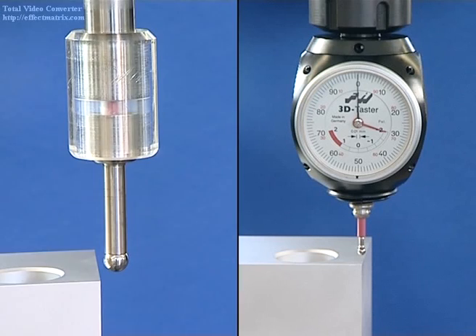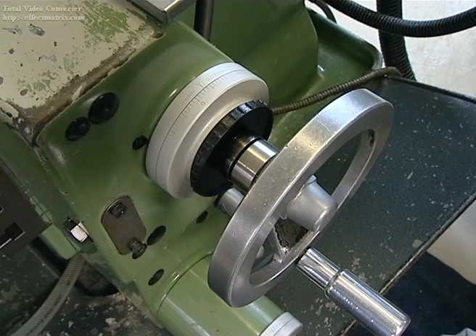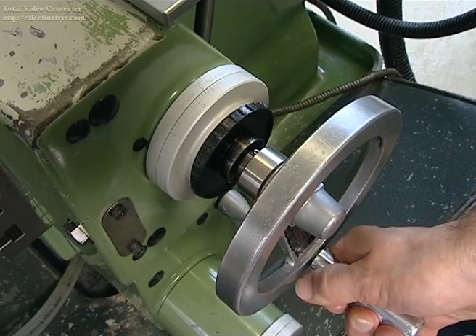In this case, minus five millimeters. To test it, the spindle is positioned at the edge. The measuring system should now indicate zero on the x-axis. However, it shows minus ten millimeters since the direction of measuring was not taken into consideration. The correct value would be plus five millimeters, not minus five millimeters.